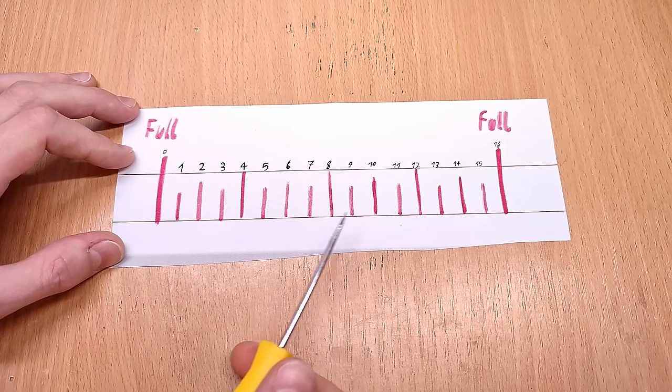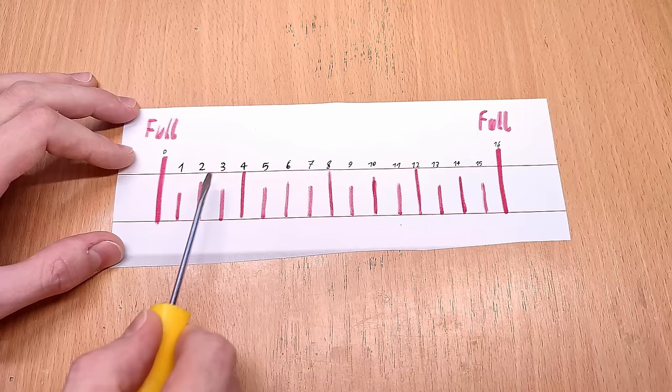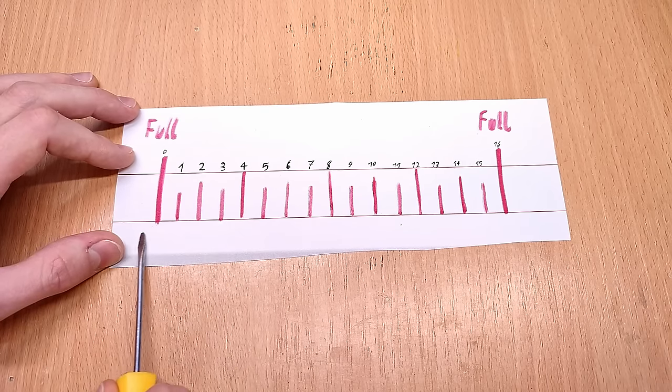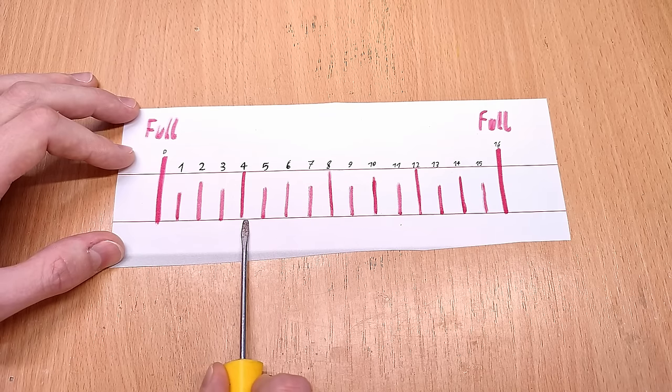Because microsteps are really just virtual steps, the controller telling the motor to go to microstep 3 out of 16 doesn't necessarily make the motor go there exactly, but it'll come to rest somewhere in the vicinity. Depending on the load on the rotor, it might even be quite a ways off. But at the end of the day, that doesn't even matter because microsteps work just as well for smoothing motion.